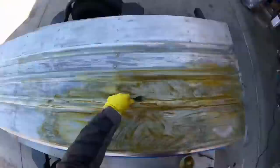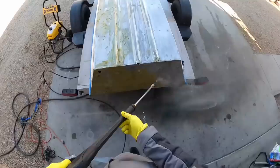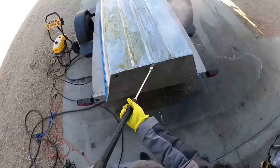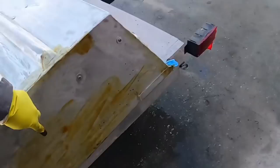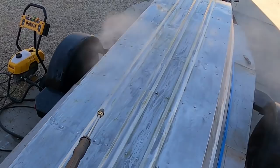Okay, so a pretty unilateral consensus from all the people I spoke with who are good at painting, or professional painters, was that the paint removers now, they just suck. They took out all the ingredients that made them great, so they're weak. You've got to find ways to prep them. So if you swish it around with a wire brush, it actually helps reapply the stuff over the old layers and new layers just like this, and it actually helps get it done. And then I used a pressure washer to get that stuff off, because that'll actually help remove some of it in turn. Get it as clean as possible.